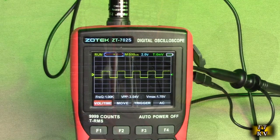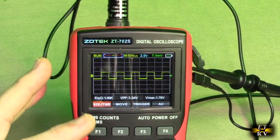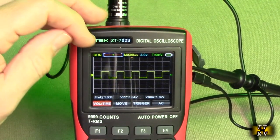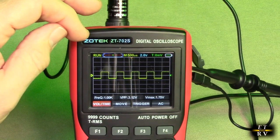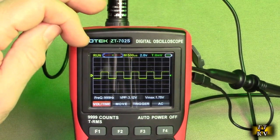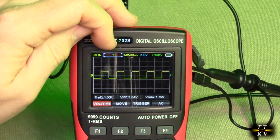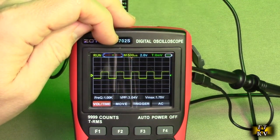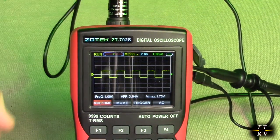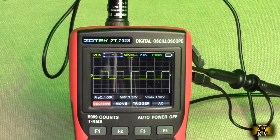Let's go over the different functions of the oscilloscope. Up in the upper left it says 'run' — that's the status display, telling you that waveform acquisition is happening. Then you see that little rectangular bar with red in the center and on each side — that displays the current time-based position within the memory depth. This is oversampling, and it allows you to get the wide bandwidth of 10 megahertz.